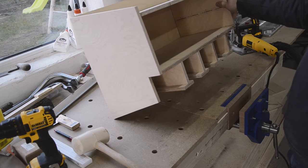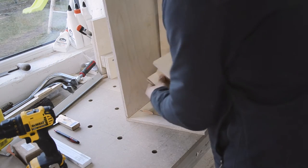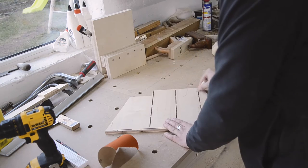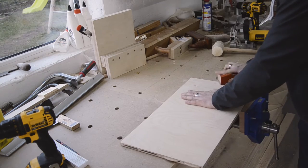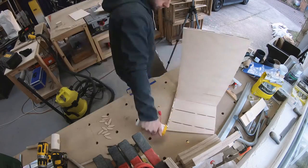Looks good after all. Except for this milling error which ruins my sides, everything fits. So I can glue it together. Beforehand, I erase all markings and sand them away, and generally smooth all parts again and chamfer the edges slightly, so you don't cut yourself. Then everything is glued and clamped.